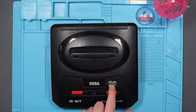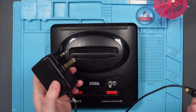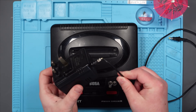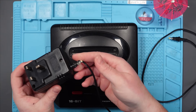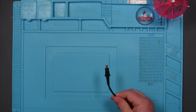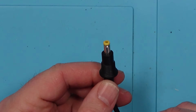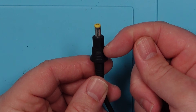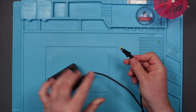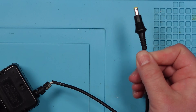So I'm curious to see what the mod looks like in this, but let's just see if we can demonstrate the issue. This is the power supply that I was given with it, and I ain't plugging that in until I've done something with that. I don't know whether you can see it, but it's not great. Because it's got this jack at the end, it's impossible to get some heat shrink tubing over this, so I'm going to do two things. I'm going to trim this back so that I can get heat shrink tubing over it, and round to here so I can cover that, and then I'm going to put another piece over here so you won't even be able to tell that it's been modified.